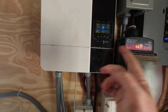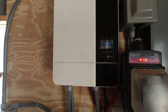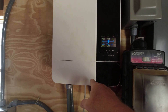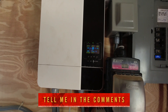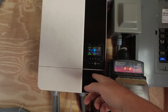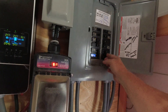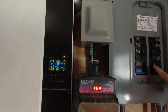I ran the AC from the pole directly in — which is 50 amps. The problem is, if I buy another inverter, I would have to do the same thing, because you have to have the same electric going to each inverter. I thought that if I ran this through like a bypass, the dryer would just bypass the inverter and use the pole power, and the inverter would just power the house. Well, it's not that smart — it doesn't work that way. If you put the dryer on, you get the error code, so let's turn it off.